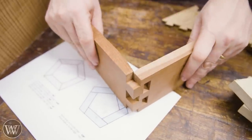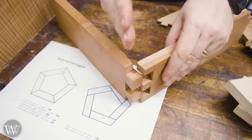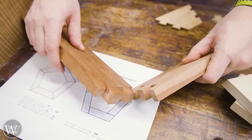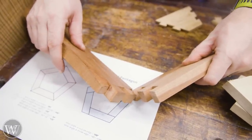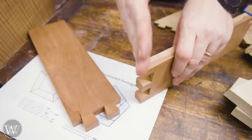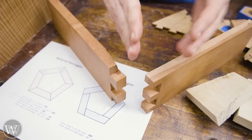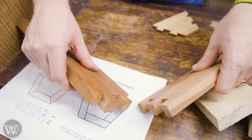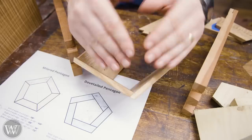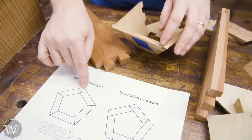To clarify: if I'm making a 90-degree box, I cut my ends at 90 degrees. If I'm making a miter box, I would cut it at 45 degrees. However, if I'm going to do an angled dovetail and make this a compound angle where the other compound is still keeping it 90 degrees, then I would actually cut these at 45 degrees. Those 45-degree bevels would come together — but that only works if these are splayed at 45 degrees. If these are splayed at any other angle, that bevel angle would be different. So I have to find the splay angle that matches the standard bevel angle for the box.